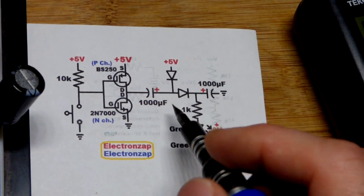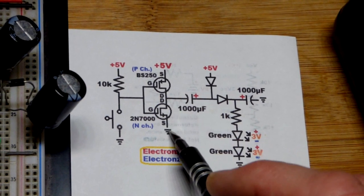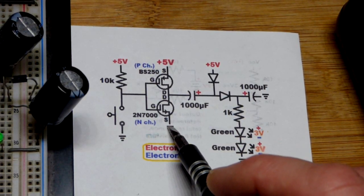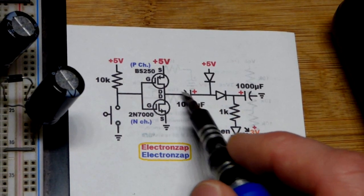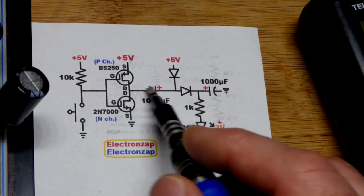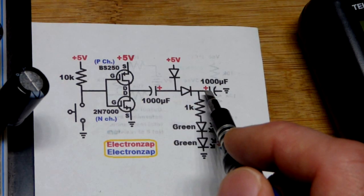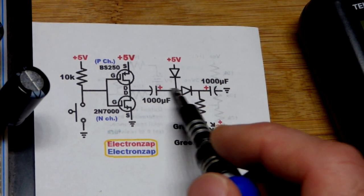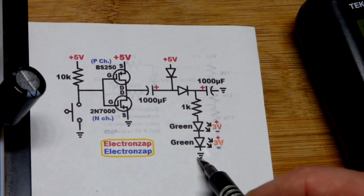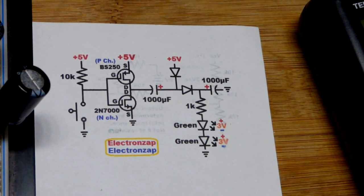For those who prefer schematics: we're not going to get the full 5 volts charging the charge pump capacitor when it's headed to ground. Even though we call it a voltage doubler, there are voltage losses. The charge pump capacitor might get to about 4.5 volts. When we switch transistors, we add roughly 5 volts to that, giving around 9.5 volts, but it's got to go through that diode which drops at least 0.5 volts, so we get about 9. Then as the capacitor discharges through the load, it goes down further. If we removed the load, our maximum voltage would probably be about 9 volts out of a theoretical 10 — so not double, but close.